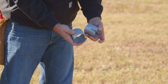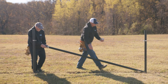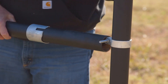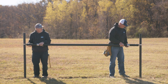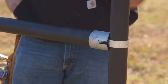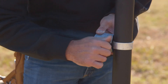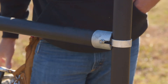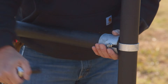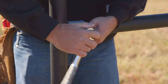Slide the collars that come with the kit over your pre-cut piece of pipe, and place the pipe over and let it rest on the band. Take the collar, slide it over, and place the jam nut on the bolt over the top of the collar, and then secure it. Repeat that process on the other side and tighten that jam nut around the collar.